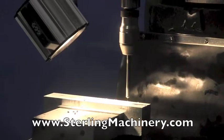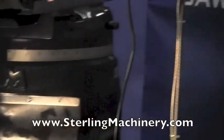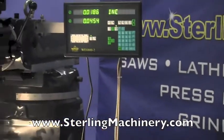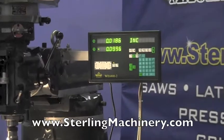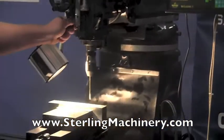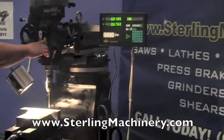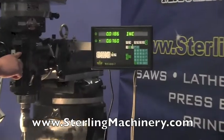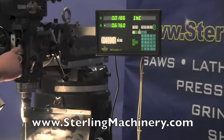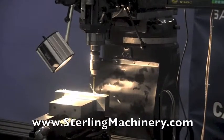If you're interested, we can also fit these out with a Z axis readout, so you could have a three axis — X, Y, and Z — and the Z will show your actual depth each time. We've set our depth stop right here to two inches, so as soon as the nut reaches two inches, it will stop and retract.